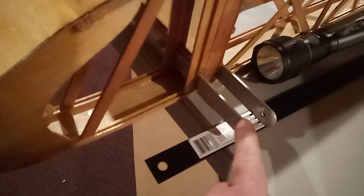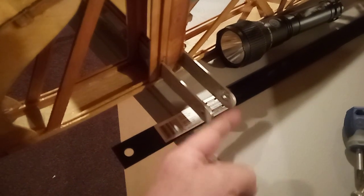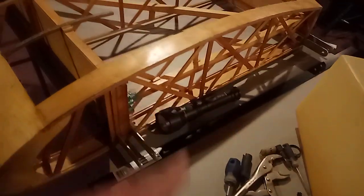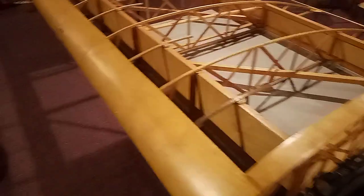I ordered enough metal to remake these wing fittings here because they're not going to be right — they're going to be off a little bit, but I can straighten them out. I'm going to replace all of these on the wings so that they're all the same level from the bottom of the wing. They're not right now, that's why the wings are all cockeyed and messed up, and that's probably why they had to have extra horsepower to fly the plane.